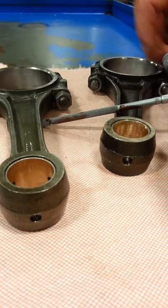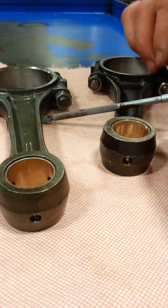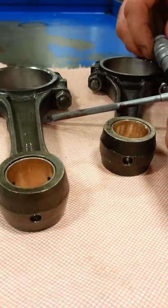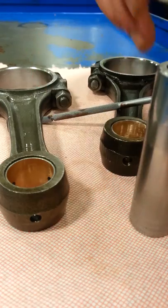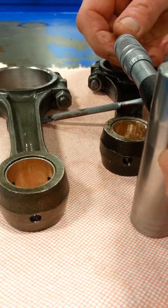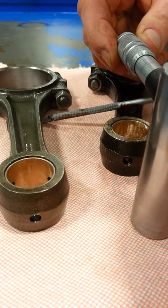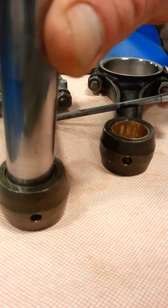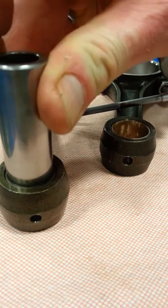I'm going to go back and do another quick measurement on this. It looks like this one is slightly different than the one I just measured - this one is coming in at just over 865. And the pin boss is 865. So if I'm slightly over, it's not quite at a 1,000 increment. Without using a 10,000th increment micrometer, it's looking like right now I have at least half a thou of clearance here.